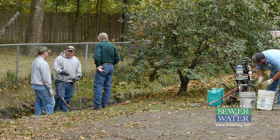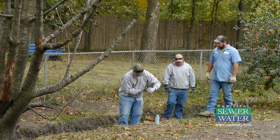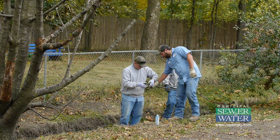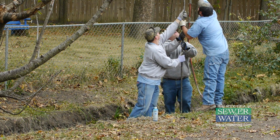They're our grout manufacturer. What we're doing here today is grouting some clay pipe joints with some infiltration coming in the joints. We're probe grouting it with Prime Resin's M2 pump. We're using their 970 hydrogel product, and basically we have driven a 1/2-inch steel pipe in the ground down to the top of the clay pipe.